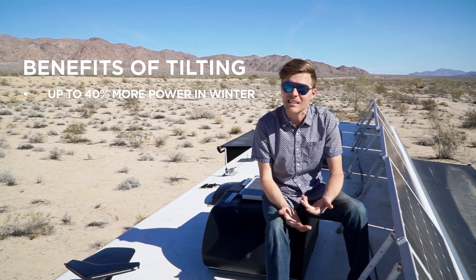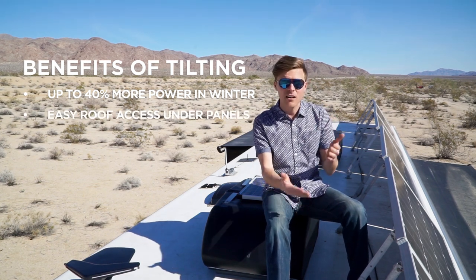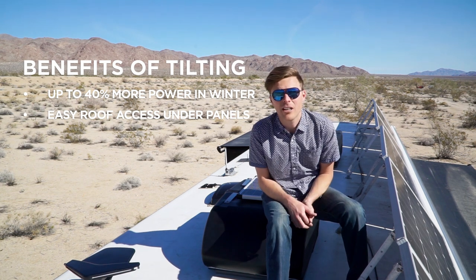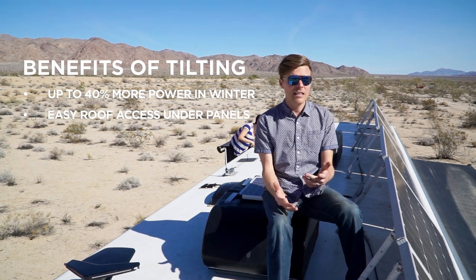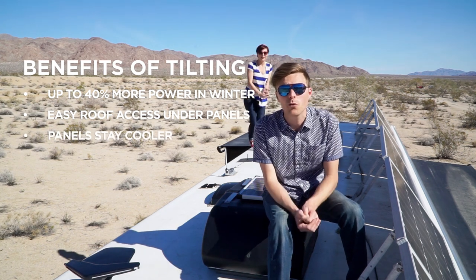For a second I thought we weren't going to have a very good result, because usually you pop those up and with each panel you watch the numbers change. But I think because we waited till a little later in the afternoon, Jason was actually shading some of the panels as he was putting them up. While tilting obviously gives you more power, there were a few unexpected benefits too — like being able to see underneath the panels to inspect waterproofing and check that screws haven't come out. Also, a breeze keeps the panels cooler and we feel like we get more power because of it.